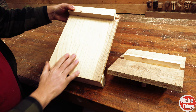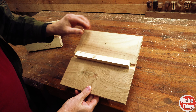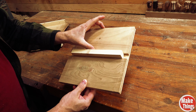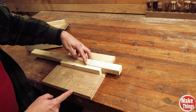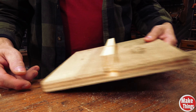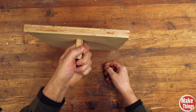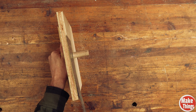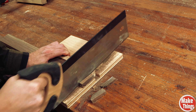There was still another problem: after making this larger hook, I didn't like the compact size — roughly four inches of width didn't feel like enough. Another issue was how far forward I would need to hold my stock when using the pull saw. So I scrapped the design again and focused on why my board was shifting with the cut. Once I understood that the motion of either pulling or pushing was causing it to rock, I rationalized that putting the dowel on the end where the force was being created would help balance out the movement — and it worked.